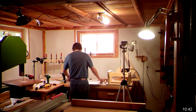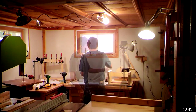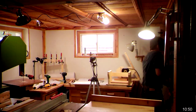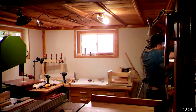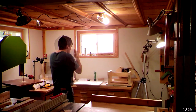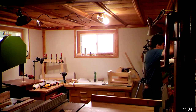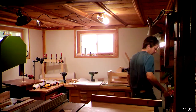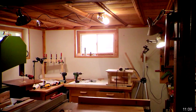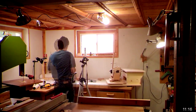Next I need to drill the holes in the table top. Checking it, I realized I cut it just a tiny bit too large, so I reduce it a bit and then mark the whole layout while recording video. I didn't use templates because it's just a grid of holes, which I drill on the drill press. Then chamfering the edges and drilling the actual holes for mounting it onto the table. I missed a few holes so I drill those out, round the corners on the bandsaw, chamfer the edges, and now I'm getting ready to put it on — video camera going and screw it on. Done.